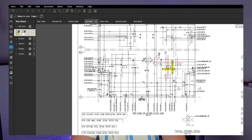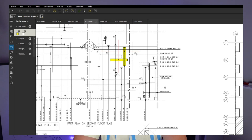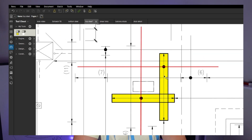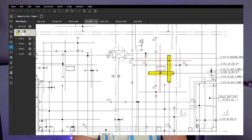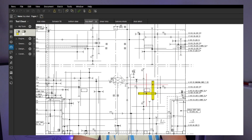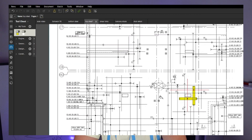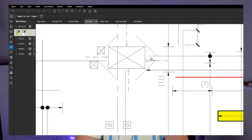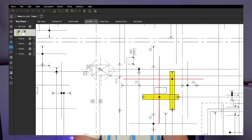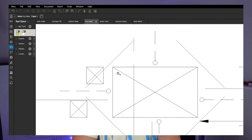When we're happy with all the castings, balconies, and extra steel, we want to make sure we've got the proper cover. Checking cover on the slab edges is straightforward. Typically using the same chairs for all the slab - but in areas with more additional steel on top, it might result in less cover. We want to grab the fixers and have them open the chairs a little bit in these areas where the extra bars are, to make sure we've got the top cover right. This applies around each column. The main drawing shows diagonal bars issued at the boxes - you'll typically see them in all the boxes. We need the cover right and the box in the correct position.